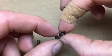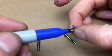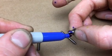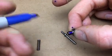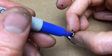I'm going to polish those, and I'm also going to polish this surface here, which was very, very rough on my gun. There was a huge machining burr here. This did a lot to take down my single and double action pulls. The inside of the hole.